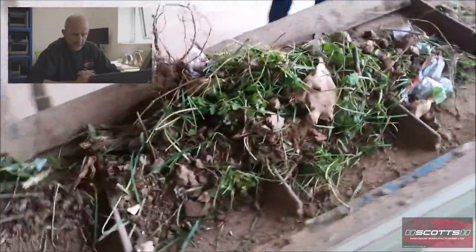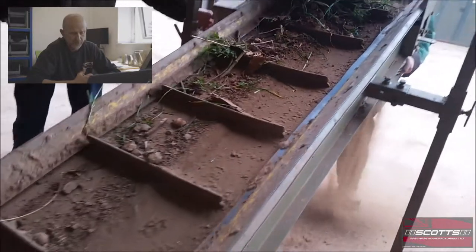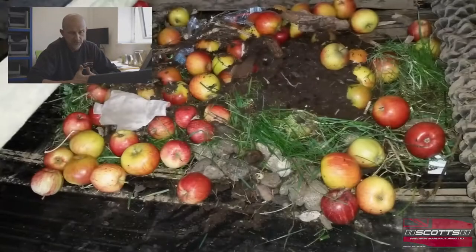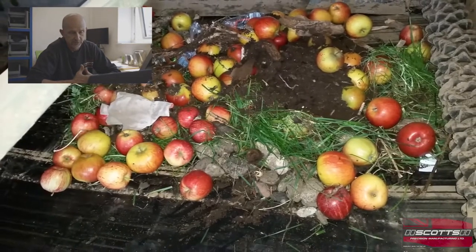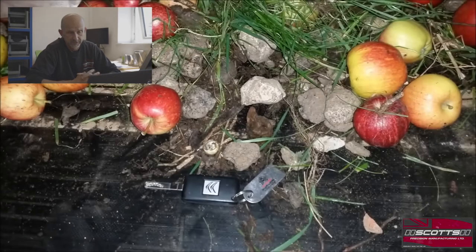In a wet environment or a dry environment, any clod roller will be fairly effective. We just slow the speed of the spirals down a little bit and have a smaller gap, just to increase the ability to clean a little bit more. Good information for you there, and hopefully that will see you through to get the machine set up well. Thank you.